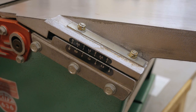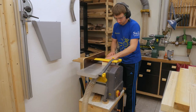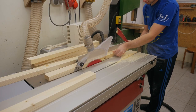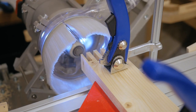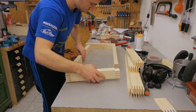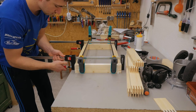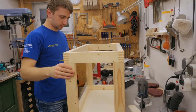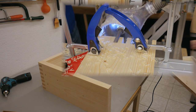Unfortunately I can't just use the machine as it needs the motor and a good belt tension — a temporary setup just isn't possible. So I first had to make the stand, or rather the cart for it. It will hold the motor, the machine, and some storage. As much as I would have liked to use the new machine, I was forced to use the old jointer/planer. I'm going relatively quickly through building the cart, as the design is pretty much the same as the cart for the plunge router I use for joinery. The short version: I have two wooden frames that are box-jointed in the corners, and these frames are then connected through rails with mortise-and-tenon joints. There's also a C-frame where the motor will be, with a plywood panel on top on which the machine sits.